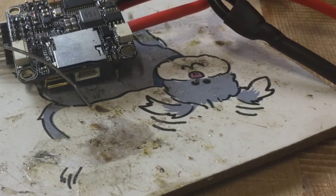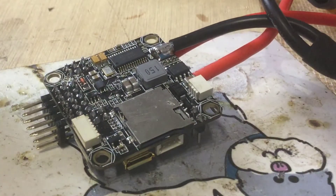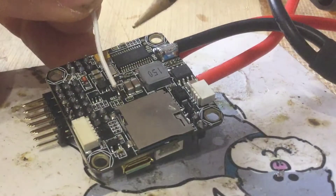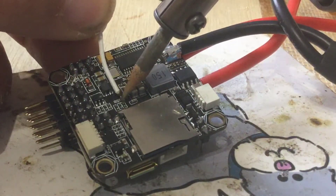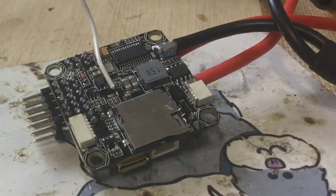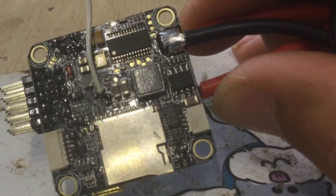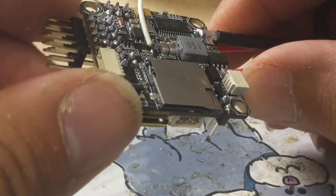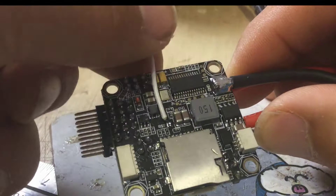Cleaning the nib up nicely, making sure you can half see what's going on. A tiny little bit of solder on the nib itself... and it's on! Happy Days — that has now been soldered on there. I'm just going to quickly visually check that myself to make sure it's not bridged over on that tiny little resistor. It's on there, it feels good.